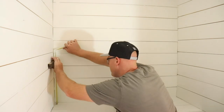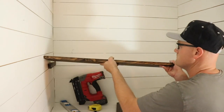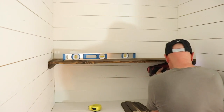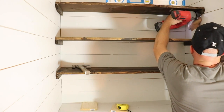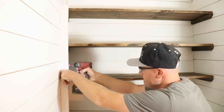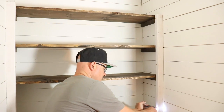We've got the toilet down there and the cabinet up here. While we're waiting on the cabinet doors to dry, I'm going to start putting these shelves up. I'm hanging these cabinet doors — they were old windows. I've got a 3/8 countersink here, running a 2-inch screw right into the shiplap. Closing the 3/8 holes.